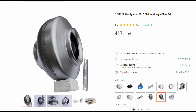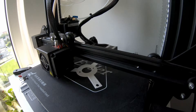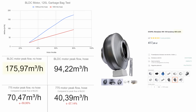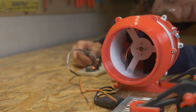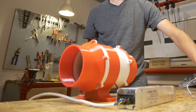Just to compare, here is the duct fan I'm using with the laser cutter — it costs 417 złoty, a bit over $100, and the flow is 400 cubic meters per hour. For the 3D-printed version you need a $10 motor, about 300 grams of filament, and a power supply. The flow is smaller — peak flow would be about 200 cubic meters per hour at max throttle. Unfortunately I wasn't able to take measurements beyond 80% throttle because the turbine wasn't well attached to the motor shaft and kept falling off at higher speeds.